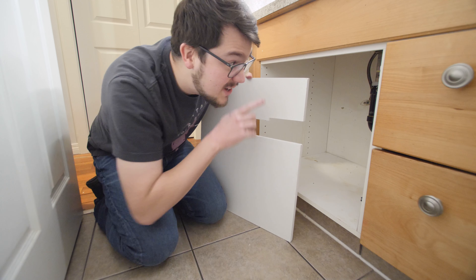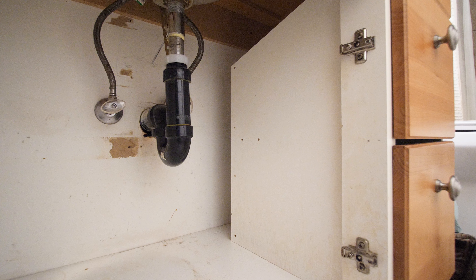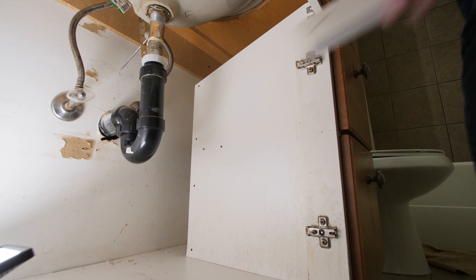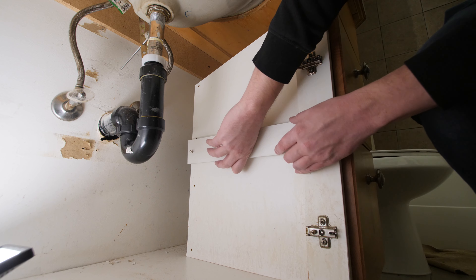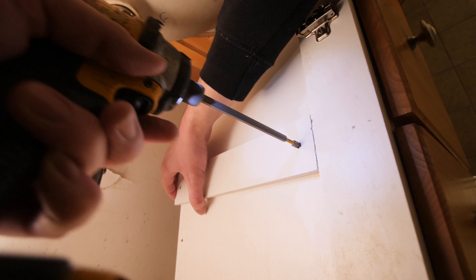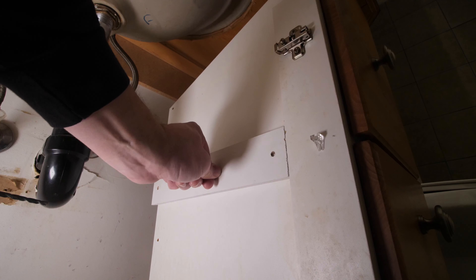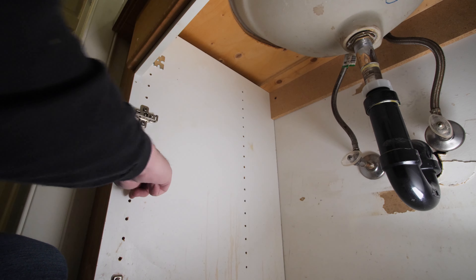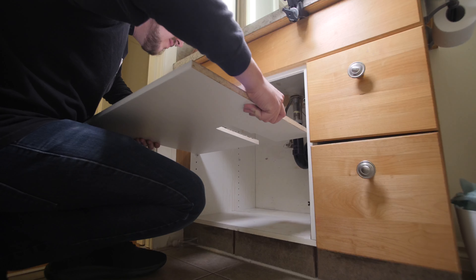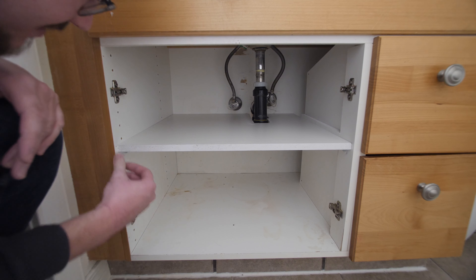It fits well now. Looking at the right side of the cabinet, there isn't exactly a straight even surface to work off of, so I had to cut a little bit of extra material to provide a stud for the shelf to be supported by. I also measured the height for the shelf pins and drilled holes for those. The left side was a breeze — no issues there. Once the shelf pins were in, we can start fitting the shelf — it fits in there quite well and I'm happy with that.